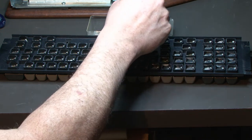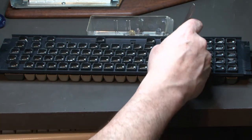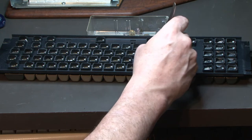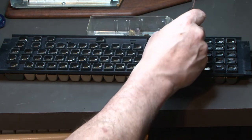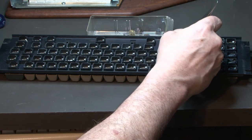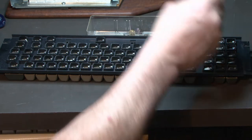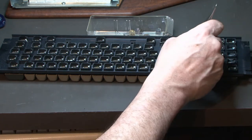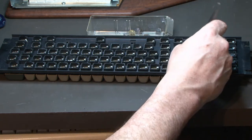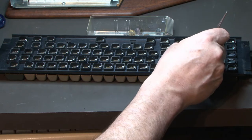I just wanted to keep it in a very bare bones configuration. But I did want to play with it a bit. So I built a card that could do 64K of RAM and or 64K of ROM. So anywhere in the address space, you could put stuff in the ROM, and you could select RAM. That way, with a couple serial ports, I could run BASIC in ROM and get the Altair doing some stuff, hook it up to a terminal. Just a little bit more than flicking the switches on the front and playing kill the bit, which is super cool, and that's kind of why I wanted to leave it original, so that was just in its very rudimentary form.